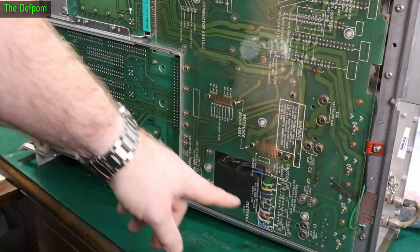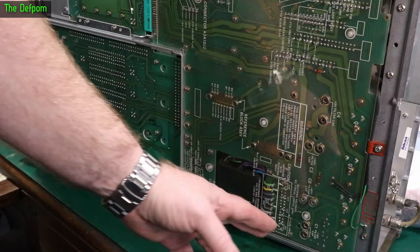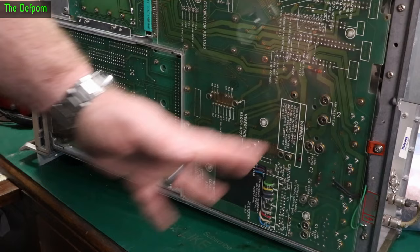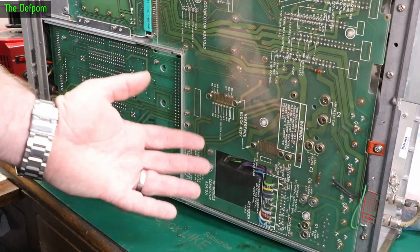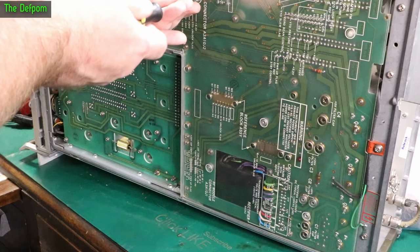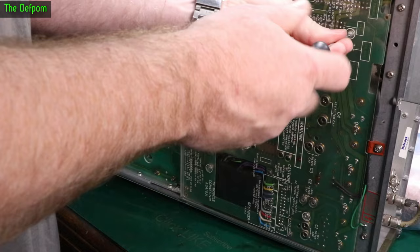There's a plastic cover under there to protect you from giving yourself a zap when it's powered up. Some of these caps we can get to quite easily — six screws — but two you can't get to because they're higher voltage supplies, probably around 70 volts, so I have to take this panel off. It only has little plastic clips, which I'm worried about breaking. These nylon plastic screws can snap if you overdo it — nylon goes brittle over time, especially with heat. I've had power supplies where nylon screws just fell off because they'd gone brittle.